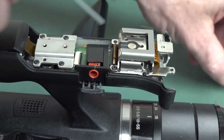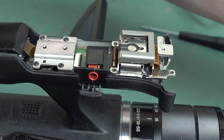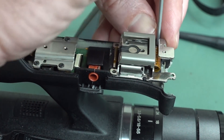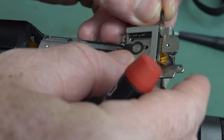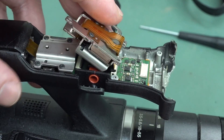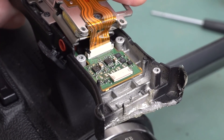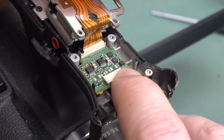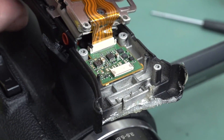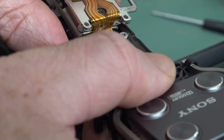So the first thing to do is try and plug the microphone capsule back in and see if it just magically works. Why that would have anything to do with the external mic I don't know — it should just detect the external mic and switch. Unless the bang has damaged the board somehow, but I don't think so. This looks like a magnesium alloy case, and the board can flex a little. I'll whack the mic capsule back in and see if that fixes it.